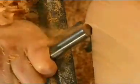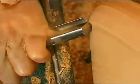Try this exercise. Swing the gouge handle during the cut, way up here, keeping the bevel on, to right down like this, where both lead bevel and trailing bevel are in line with the surface. Your hands will begin to tell you at what point in the swing this or that type of wood best likes to be cut. Such an exercise builds ability into your hands.